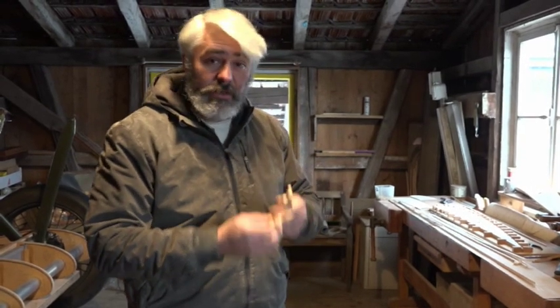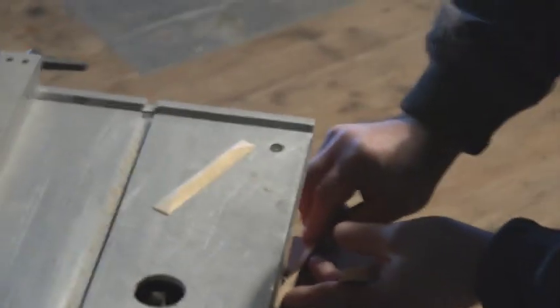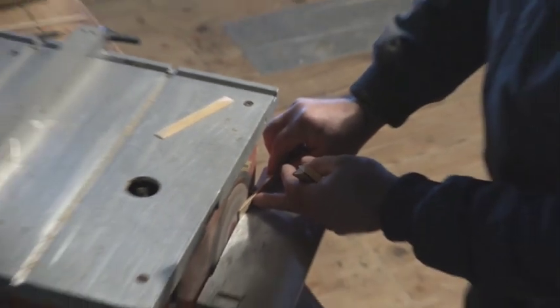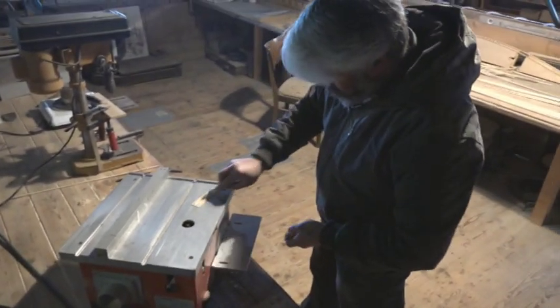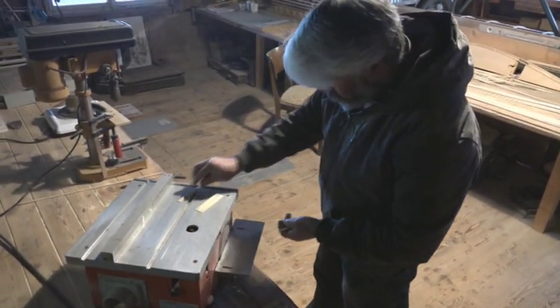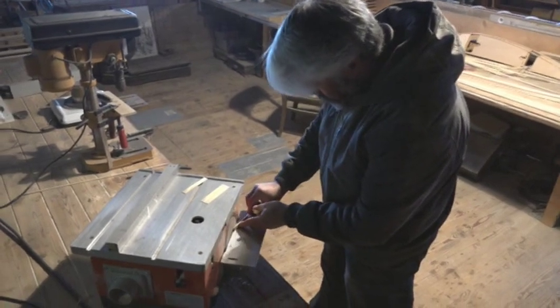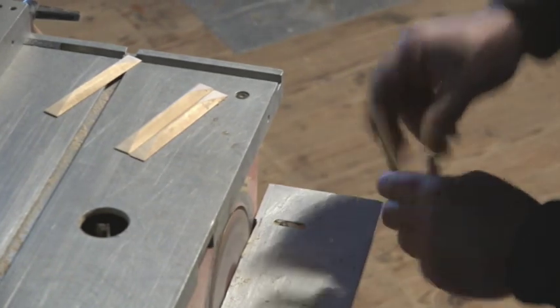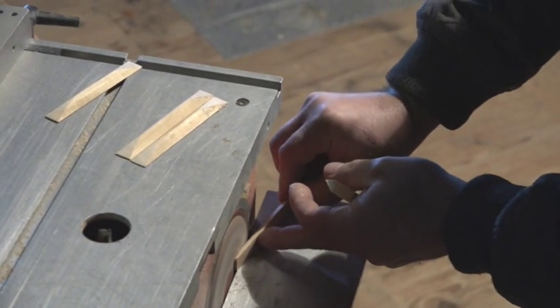That means you are not able to produce a stronger aircraft by putting more material in it, by making things thicker and stronger. The opposite is the case. You have to take off what you don't need to prevent building up of loads, which the aircraft structure has to carry under certain circumstances.